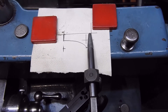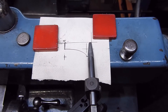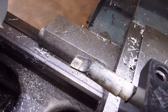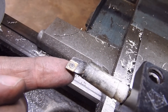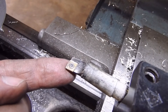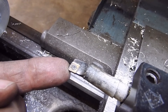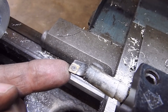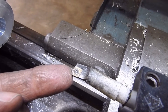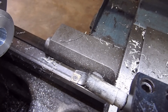After that, as you can see, I've reversed the stylus so I've got my point on the end. The reason for that is that my tool, which is a little boring bar, has that same angle on it. So what we're trying to do is make sure that the point of the boring bar and the angle of the stylus match. From there on it's just a question of repeating the same sort of thing — just doing it in a hole.